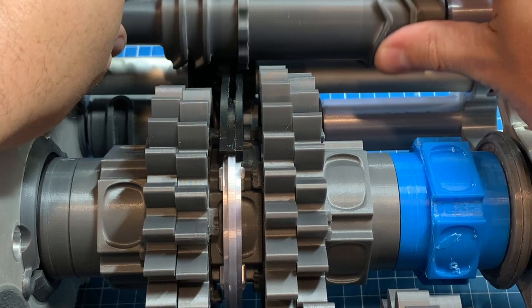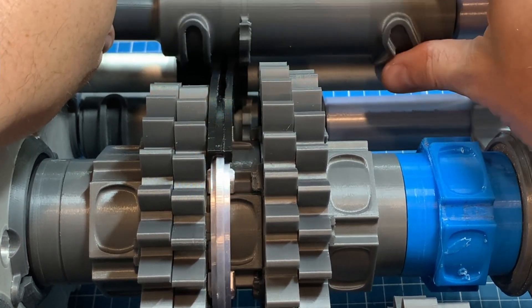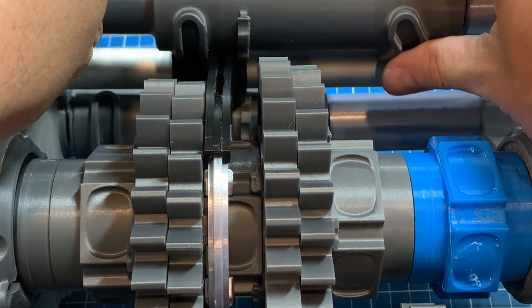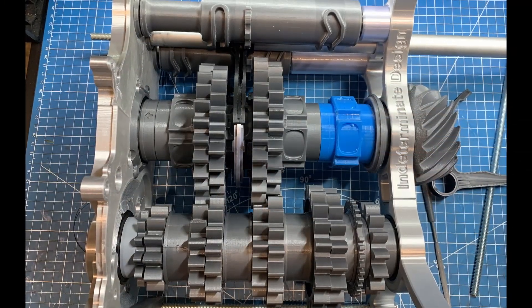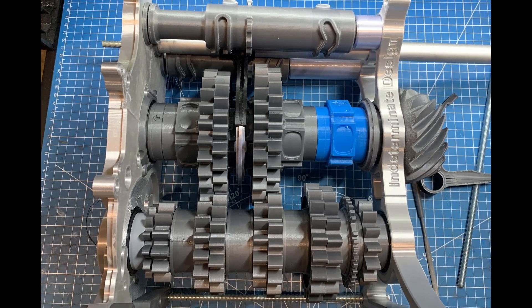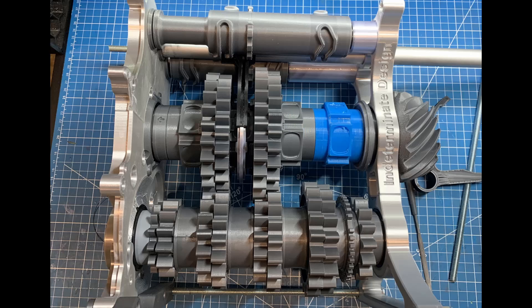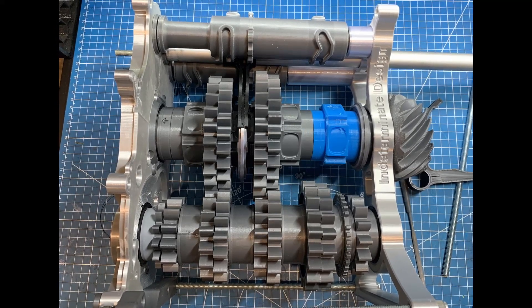As you can see, it's actually shifting really well. The gears are fully engaging and disengaging. There's a little more play between the shift fork and the slider than I want, so I'm going to tweak that, and I've got another tweak or two with the shafts themselves for length. That's going to wrap it up for this video. I'm going to keep printing and tweaking, and hopefully for the next video I'll actually have the mechanical design complete for the gearbox. Thanks for watching and stay safe out there.